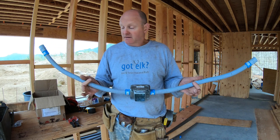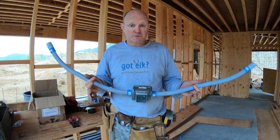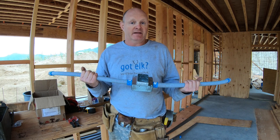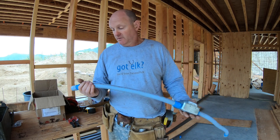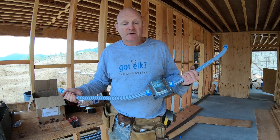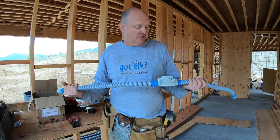The other thing is, apparently according to code you can use half-inch conduit, but I use three-quarters because half-inch is a real pain to route the wire through. So I go a little bit larger on the size — it costs a few bucks more, but makes the installation job easier.